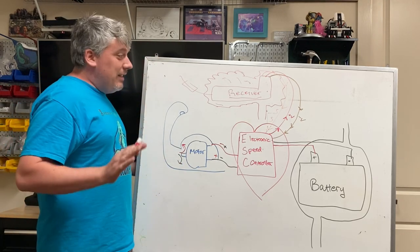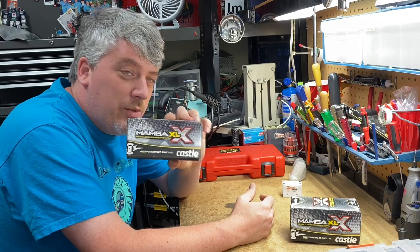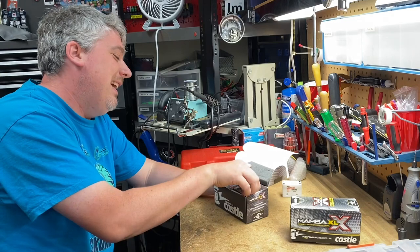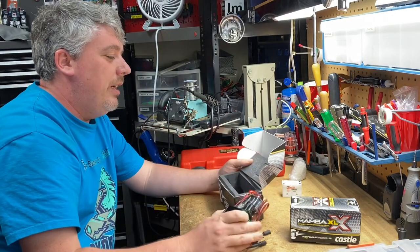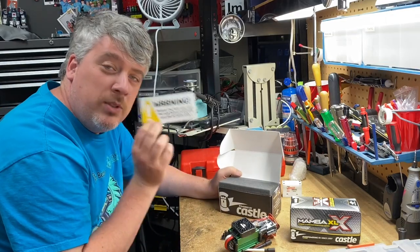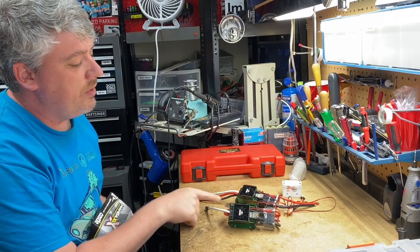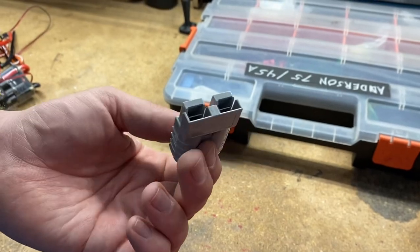So this is the basic setup and the basic parts inside your robot and how they interact with each other. This is a Castle XLX speed controller — this is going to be the heart of Scorpios, Mamba number five. We did use these when we fought Tombstone and Ice Wave in season five, and we were even using one for the weapon in season four. When you open up your speed controllers, if they come with giant warning labels, I would recommend reading them. I'm going to cut off these connectors that come with it and add the Anderson connectors that we use inside the robot.